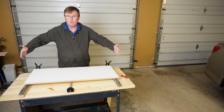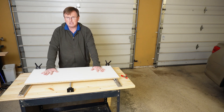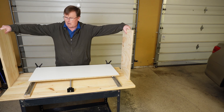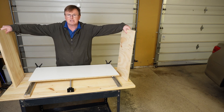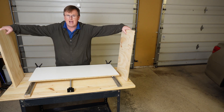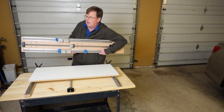We have a big Y-axis, so that means we can mill very large CNC projects through a process called tiling. At the ends of this table we'll have a couple of boards coming up, mounted just off the edge of the table and bracketed in. Across the main area spanning that gap we're going to fix our X-axis, and that will put the router along like so — this plate will float right on that main X-axis.